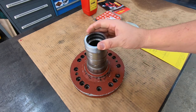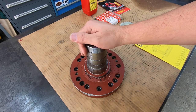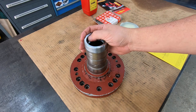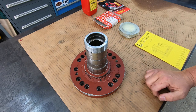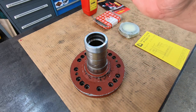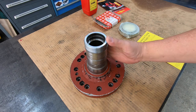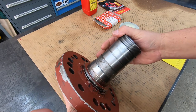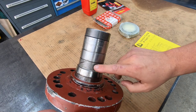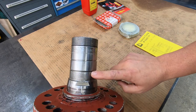And he says what that machine does is it removes the edible oils from the solids, from 40% solids down to 2%. And he says it does run at 5,400 RPM and it actually produces 15 gallons of oil per minute. All right. But they're running this and they discovered they had a bad bearing fit right here. And you can see just how bad this guy was worn.